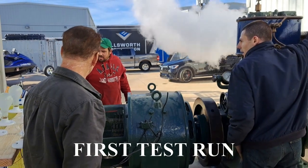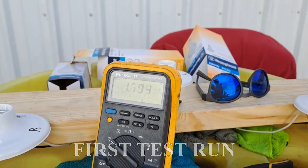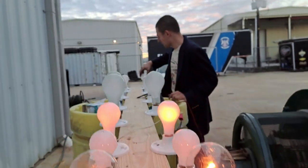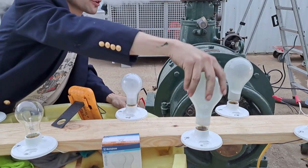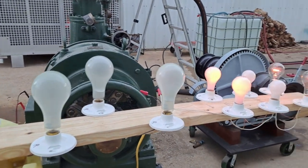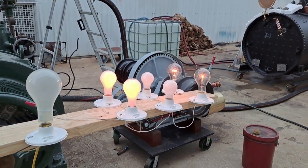One bolt — here it comes, maybe even two of them. Anyway, if I screw the rheostat lamps back in, you'll see that the load becomes brighter. And if I start screwing them out again, it'll drop away and the rheostat will light up. It sheds load. And if I screw these back in, it goes back to the load and will get significantly brighter.